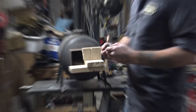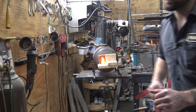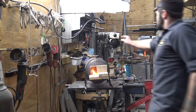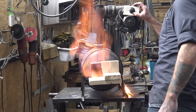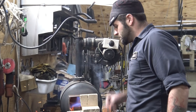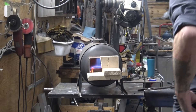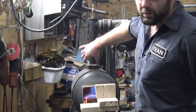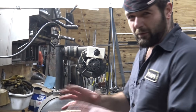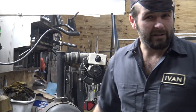This is a forge I made out of an old propane tank. It works pretty good — definitely gets the job done. We've got to run it off of natural gas with a blower motor hooked up to it. I built an orifice down through the main chamber, kind of waffled out, like what you'd see if you looked at the end of a propane torch. Took a few tries to get it right, but now we've got a real good burn on it.